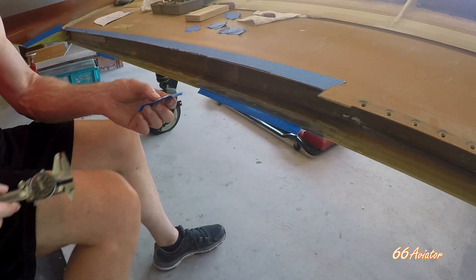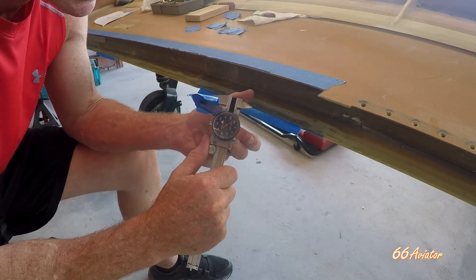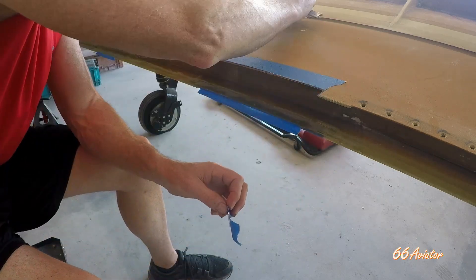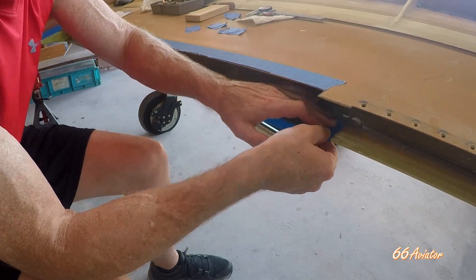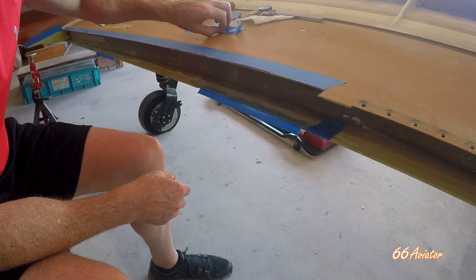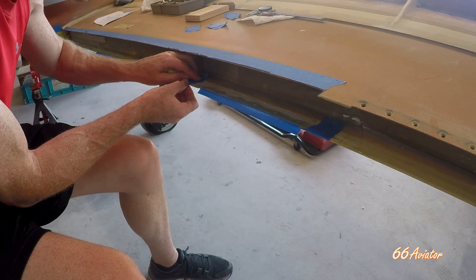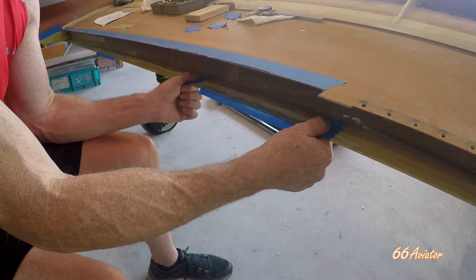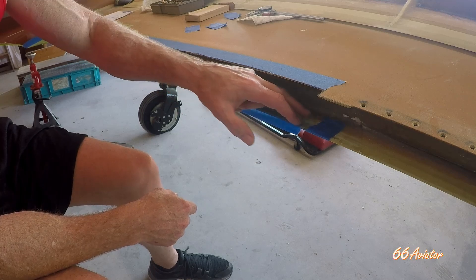This is my little spacer — it's a washer. They were all around 70 thousandths, and four pieces of tape brings them up to 88 thousandths, which is close enough because I wanted about 80 thousandths. By the time I clamp this down it'll be nice and tight. This goes in here and sits right where the angle iron can clamp down just outside of the hinge area, giving the same setup on both ends of the hinge. The angle iron will bridge that gap to leave an 80-thousandths layer of fiberglass right there — perfect.